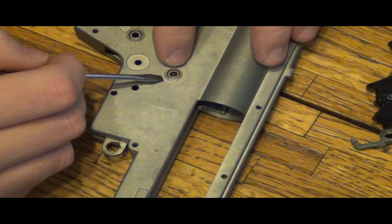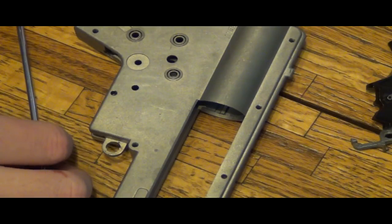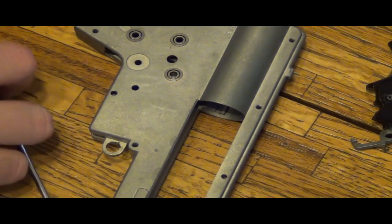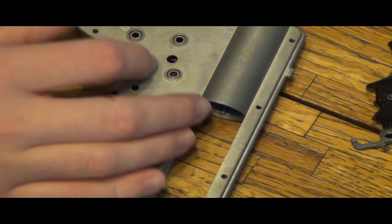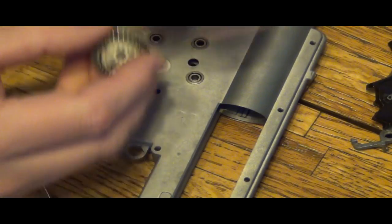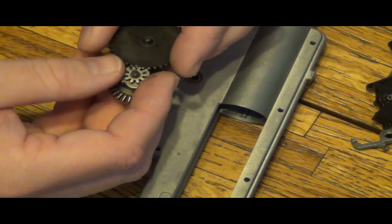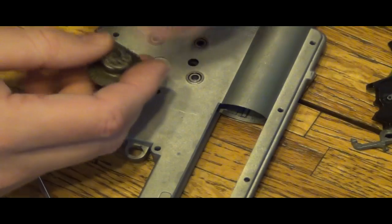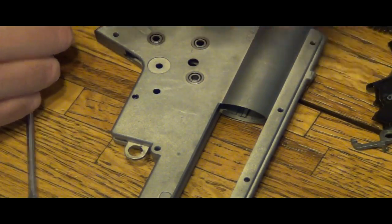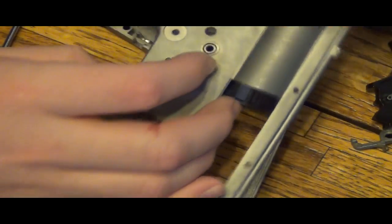So you're going to just want to test everything at the final result. You can break in your gears. However, I don't think it's necessary. It's only really necessary if they don't mesh properly. You've got different brands and so forth. And so the teeth, like on a bevel versus a spur, let's say they're different brands, don't mesh really good, then when you go break it in, it'll mesh a little bit faster, just simply because you can have it rotating a lot more without the spring in there in the upper assembly area to your gearbox.